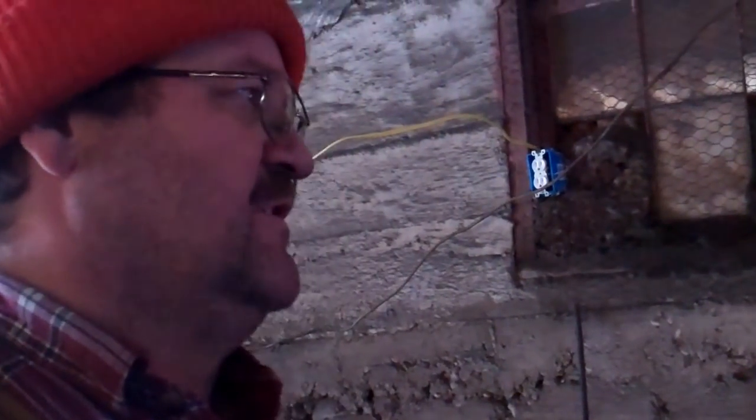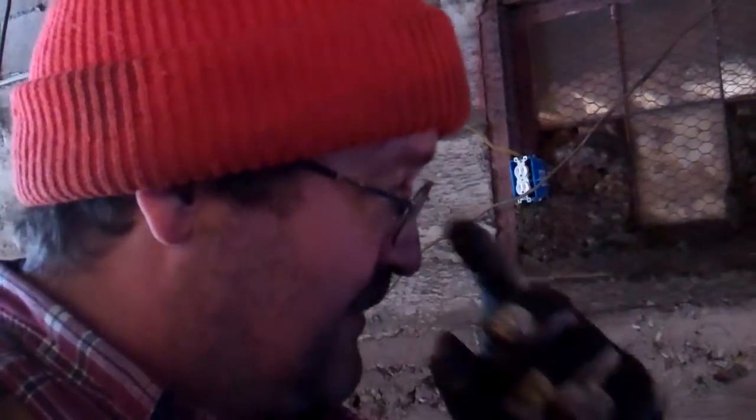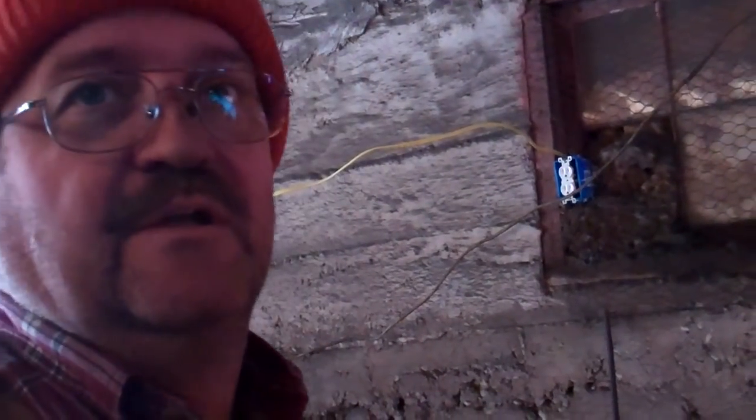A lot of smelts. And depending on what you do, you vary that a little bit. Him going that fast, and he's an ornamental blacksmith, he's after primarily a very low carbon iron product. And for him, being very solid is most important. I slow things down a little bit. I run between 0.25 and 0.27 grams of charcoal per square centimeter per minute. And I get a slightly higher carbon content product. But it's usually not as solid. It's more coarse. It's got more crud in it than what he gets.